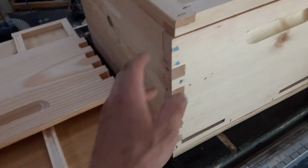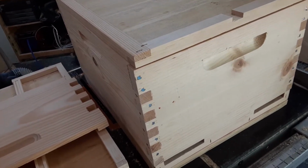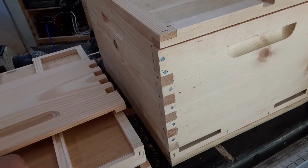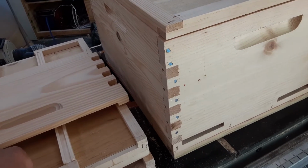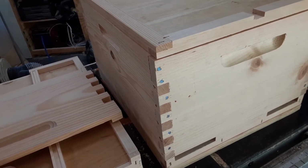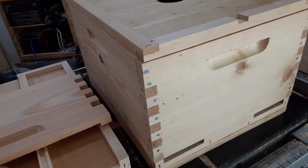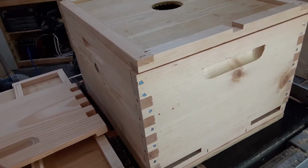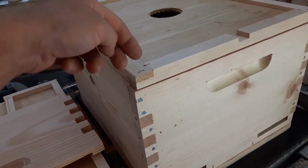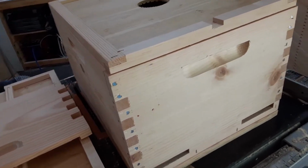Sorry for the side note there, but personally, I built houses for a long time, all over the country, and I've got to tell you, staples hold better than nails, period. They just do. I don't know if you ever pulled a sheet of plywood up that's stapled down versus one that's ring shank nailed down. Man, those staples hold on. You pop the plywood off and the staple is still there. That's the only way to get it off, and it's a huge pain.